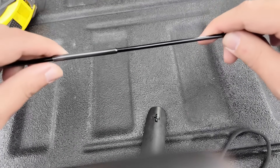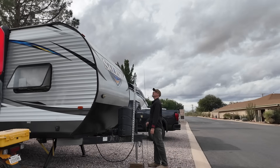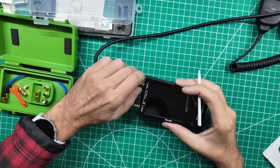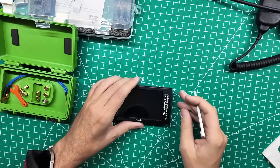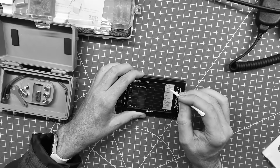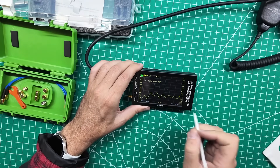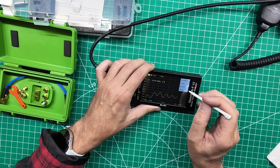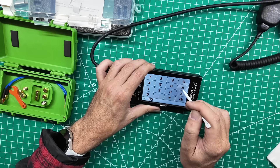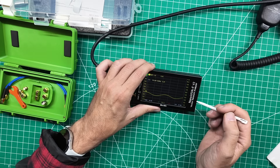Putting the top section back on - now she's 99 and a half inches tall, taller than me and taller than my antenna mount. At 99.5 inches - about two and a half meters - that's approximately a quarter wave on 10 meters. Calibrating for 10 meters at 28 to 29 MHz, and we're around 2 to 1 the whole way across - perfectly tunable. On six meters it just keeps going up; we went from the bottom, to the middle, to the top as we kept adding sections. That's a 4 to 1 SWR on six meters now.